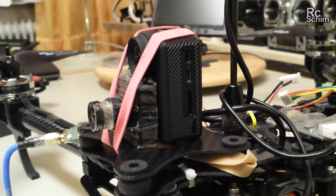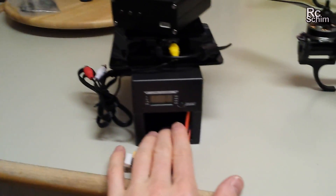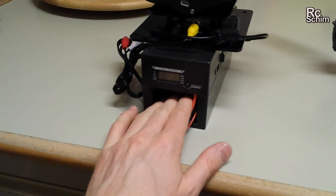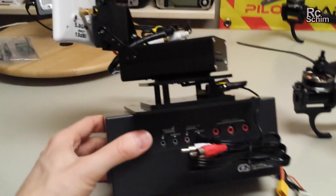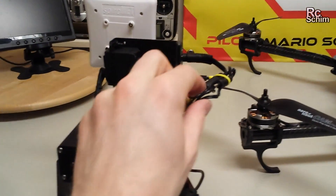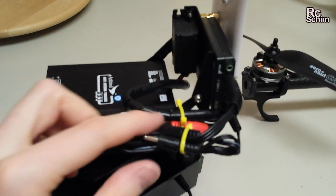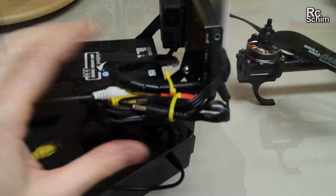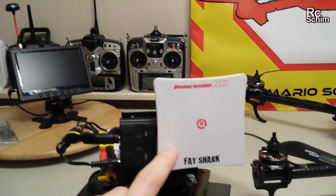So how to mount the M20 on a quadcopter — well, that's the ideal way if you ask me. It looks kind of funny but it holds well. I once again used the Quantum Ground Station box, which is basically a voltage regulator with a battery bay. I mount the ArcBird antenna tracker on top of this with a tripod screw. If you have this as a permanent installation you might want to do a soldering job to get a really neat cable setup — this is really a temporary installation with a few cable ties. I'm now using a single receiver with a narrow Fatshark patch.